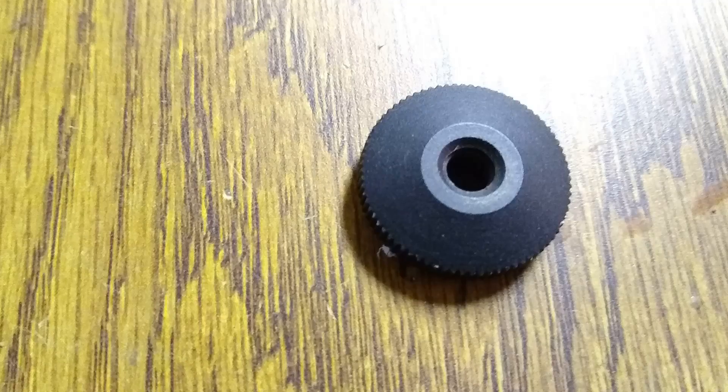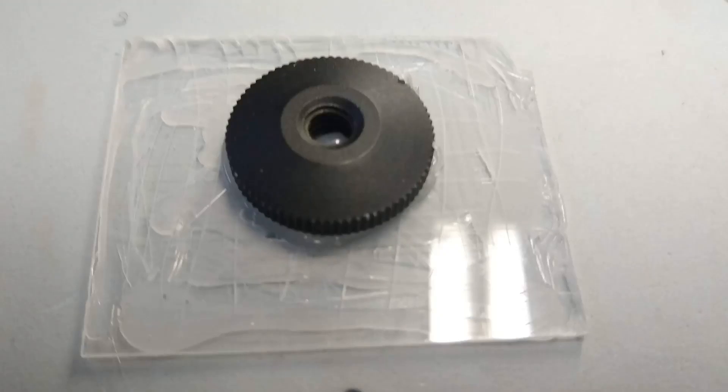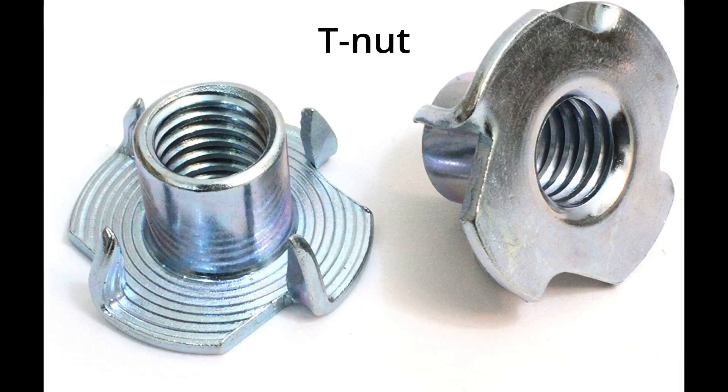For a tripod mount, I used a thin piece of plastic, scarred it with some sandpaper, and then glued it to the bottom of the main foam piece, making sure to get it somewhat centered. I had a metal hot shoe nut that came with some camera attachment, and glued the tripod mount to the plastic — I felt the plastic gave the mount a little more stability. You could easily use a quarter inch nut or a T-nut with a 20 count thread if you cannot find a hot shoe nut like the one I used. If you're using a T-nut, you could probably skip the plastic and mount the T-nut directly into the foam since they have a serrated edge. I will leave links in the description to some hot shoe nuts I found on Amazon and eBay.